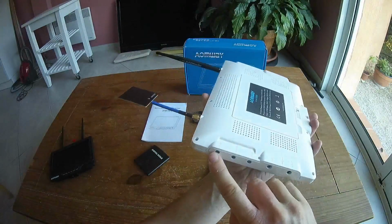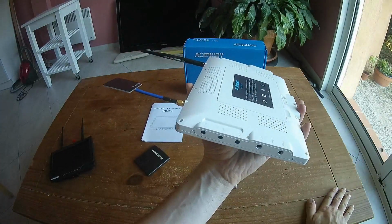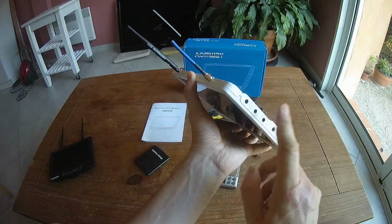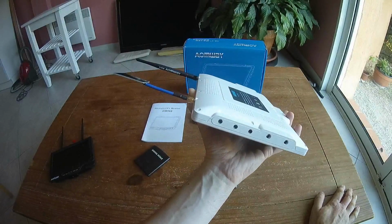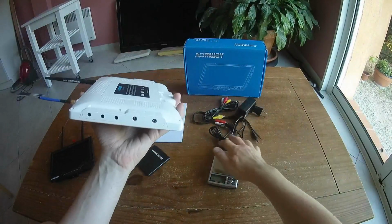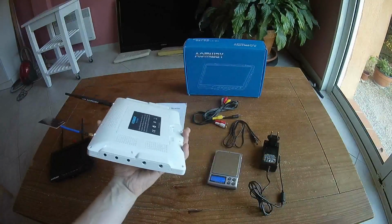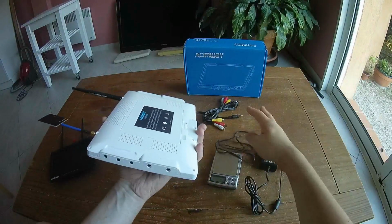On the right side you can find a lot of inputs and outputs too. First of all, from the top, you can find the AV out to export the signal to another recorder or FPV monitor. This is audio, and the last is an AV in to send any external source into this FPV monitor. All three are 3.5mm jack format. Here the DC in, where you plug your provided charger to recharge the built-in battery, or if you prefer, from another LiPo thanks to this cable.